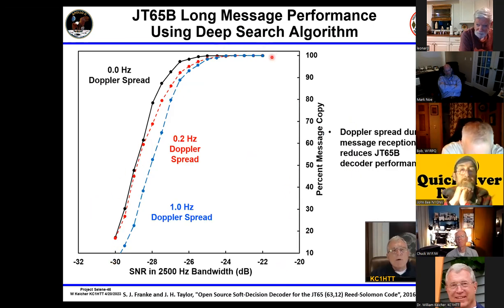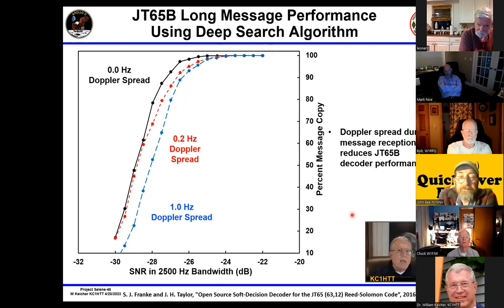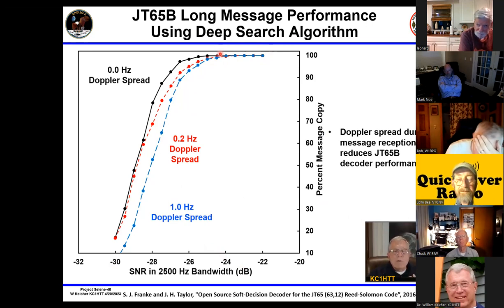This is the performance of JT65B as published by Joe Taylor from computer simulations with Doppler shift introduced. When people say JT65 works to minus 25 dB, it means at minus 25 dB referenced to 2,500 Hz bandwidth, it's almost guaranteed to work — that's like Shannon's theorem, noiseless communication. We're working down in a much lower SNR region, and the ionosphere is randomly moving us around. So there's a good fraction of the time we'll get nothing, but if you persist, you will eventually receive a signal.